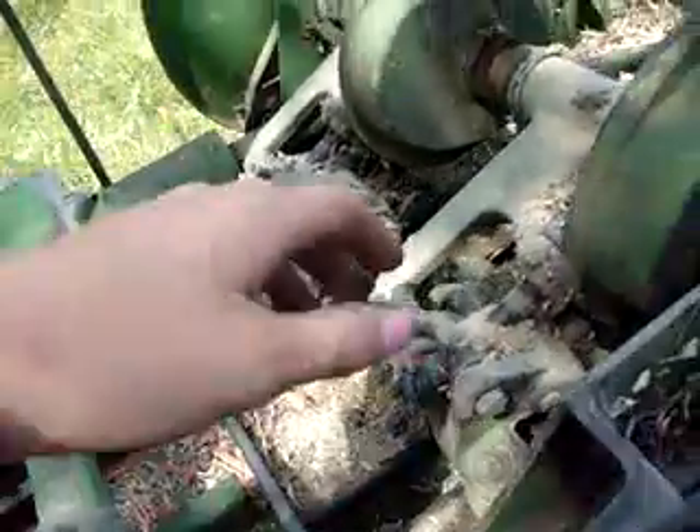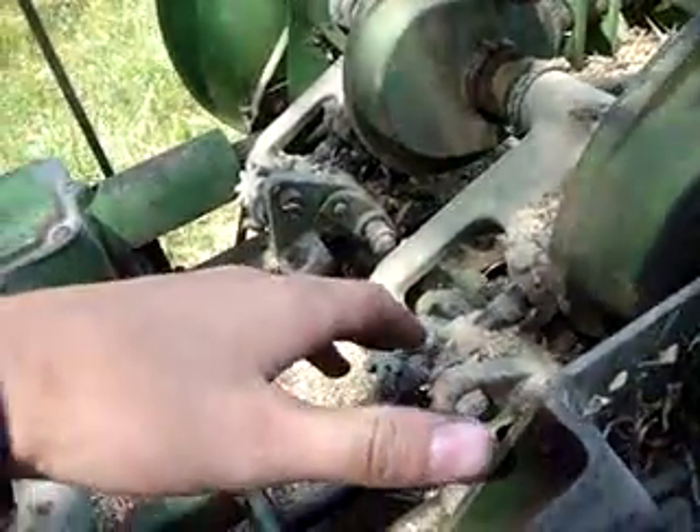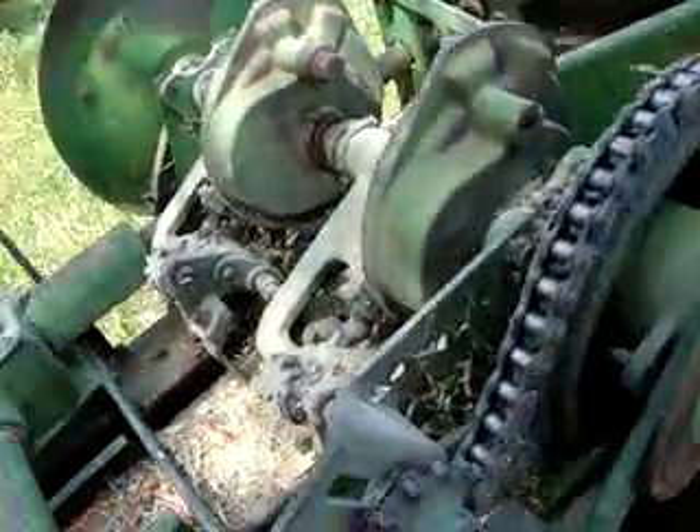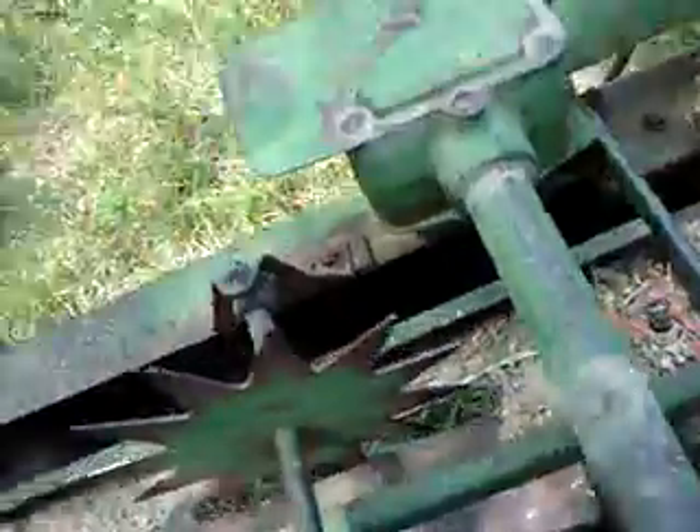So that all this twining session happens when the plunger's on the backstroke, so that the plunger isn't pushing hay through when these big needles are feeding the twine up — or also to break them off too.